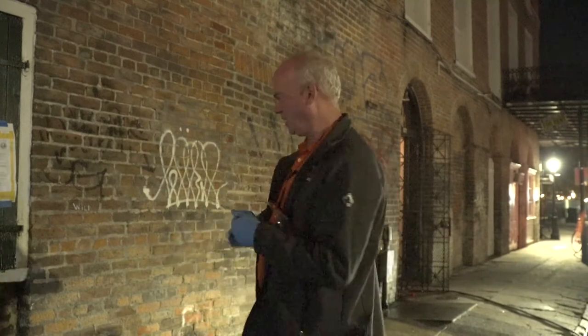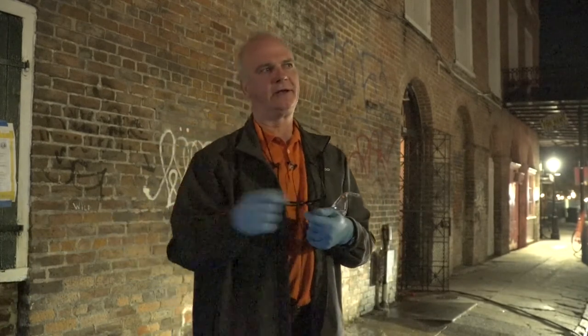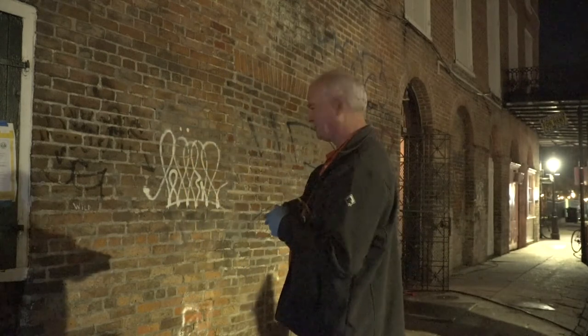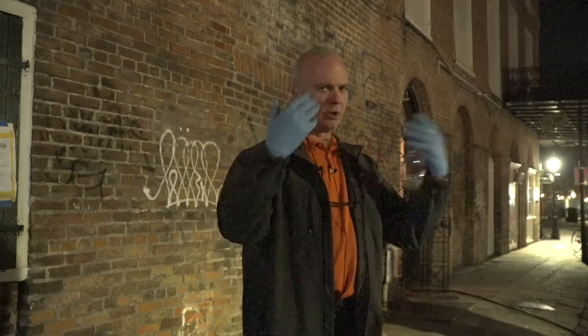Yeah, so that's the standard product, wet-on-wet application. I did nothing different on that. I actually brushed that on because I didn't want to get out here with the sprayer. So there was nothing different about that one. If I'd have put a third coat on it, it would probably work a little better. But you notice I hit it with all that pressure and it's still dry. The water didn't make it all the way through it. That's because it's blowing everything off.